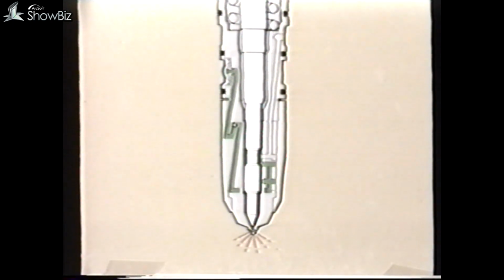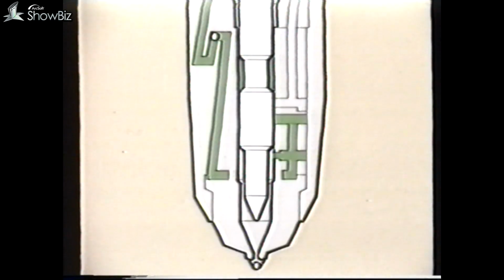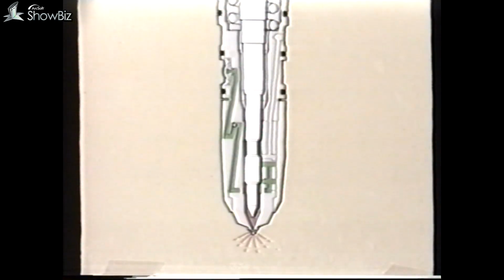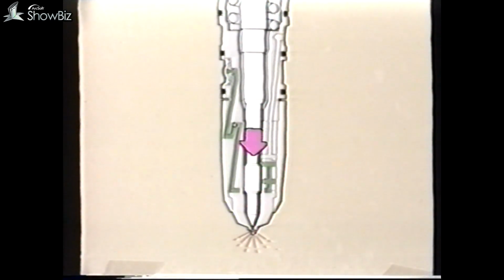As an alternative, if the pushrod is set tight, it will reduce the filling period of the injector, causing an under-fuel condition and reduced engine power. This condition is known as set short. In extreme cases, damage to the injector cup and camshaft may result because the crush imposed on the injector will be in excess of the designed limit. Therefore, care must be taken during the setting procedures.